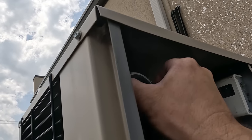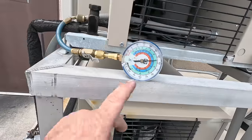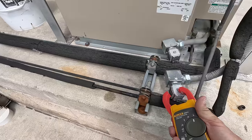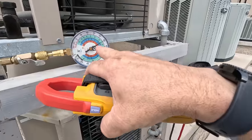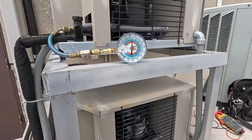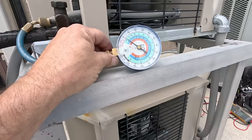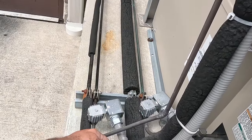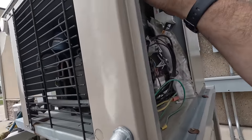That's not very pleasant to turn — I wonder if by chance that's sticking. Well, obviously not because it rotated on its own. We just told it to go into a defrost. It's not pumping down yet, taking a sweet time. Let's see if it's still got power to that coil — easy cheap trick, done this multiple times. As you can see right there, zero amps. Come over to this one — 18 amps, obviously picking up the magnetic field. We're still not pumping down very quickly, it's finally dropping. I don't know if we just need new insulation, if it's a malfunction, or if the TXV was flooding back. It went down pretty fast. Come on — click! Right off at one pound and it's holding there. So we want to make sure that's actually holding. The insulation out here is garbage because the sun's eaten it up. Still holding there. Just a timed-off defrost, so let's go ahead and pick it back out.